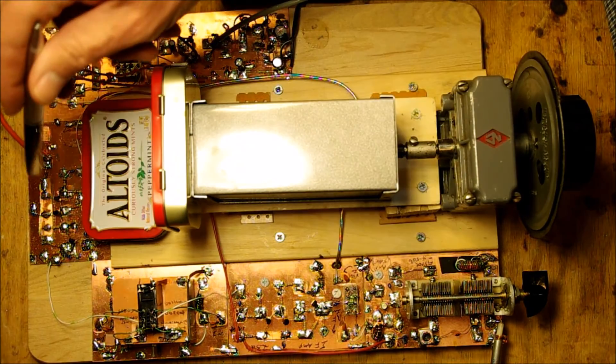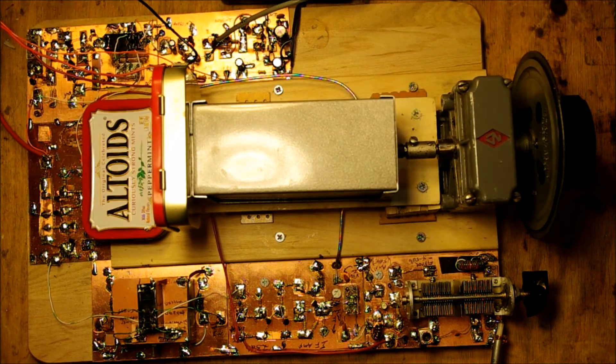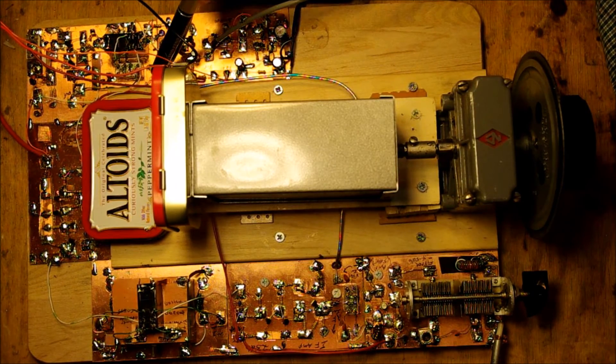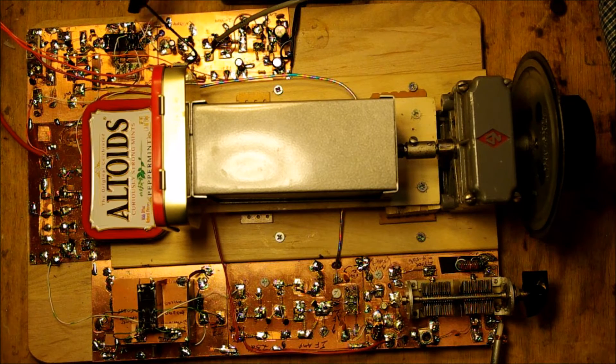The 2.4 kHz from the CM455 filter is a little too tight for AM. I have another IF amp after the filter. The BFO over here is built around a 455 kc ceramic resonator from the junk box. There are a couple of transistors afterwards — a buffer and an amplifier — and that sends BFO energy to another SBL-1 which is the product detector. So you have the 455 kc IF and the BFO energy coming in, and audio coming out.